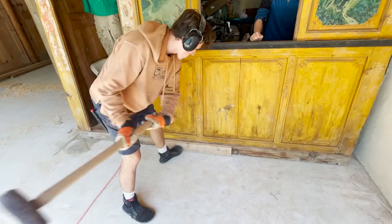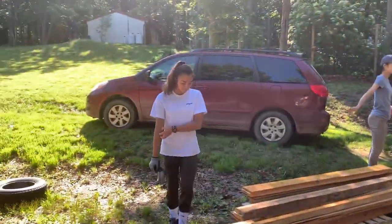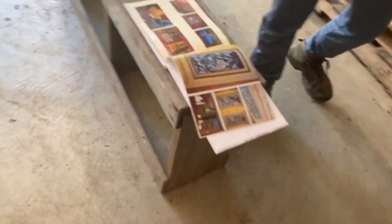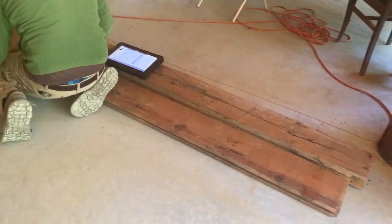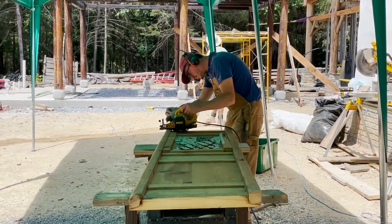The other crew was the wood crew — that's the crew I was in. We had to go to the storage unit and sort through everything, figure out what pieces we needed, and also other pieces for the timber crew in the kitchen. To figure that out, we were mostly just looking at the book that has pictures of the house, and then I was using some of my dad's diagrams that he drew in pencil, which had some of the pieces labeled to figure out the categories and everything. Then we started laying out and measuring the panel walls, because they used to be set into the ground in the old house, so a few inches needed to be cut off to accommodate for that.